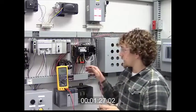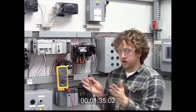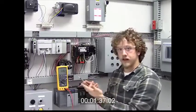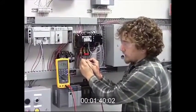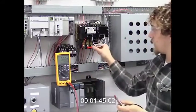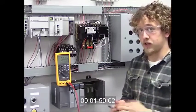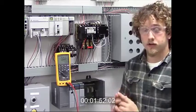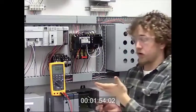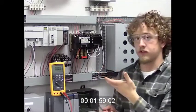So what I should read at my overload contacts, which are going to the input card, I should read 24 volts because they're open. And if I read zero volts, they would be closed and we should have been receiving that signal to the input card. As I go to the contacts, they are reading my 24 volt signal. So I'm going to go ahead and reset them and read them again to make sure they're working properly. Now that the contacts are closed, they should read zero volts. Our overload contacts are working properly, and we know we lost the phase to the overload. So now we have to go and see why the overload is tripped.